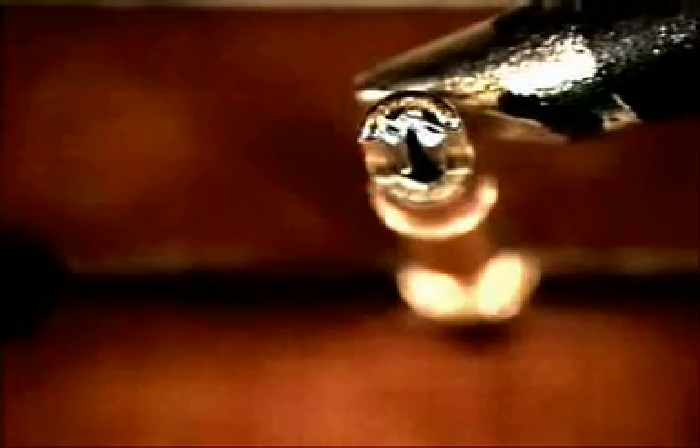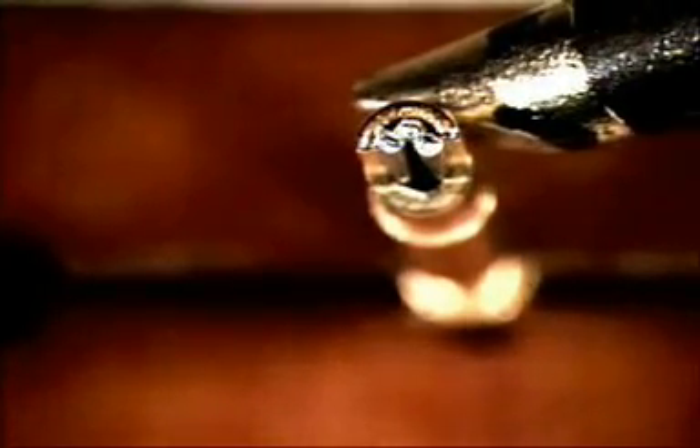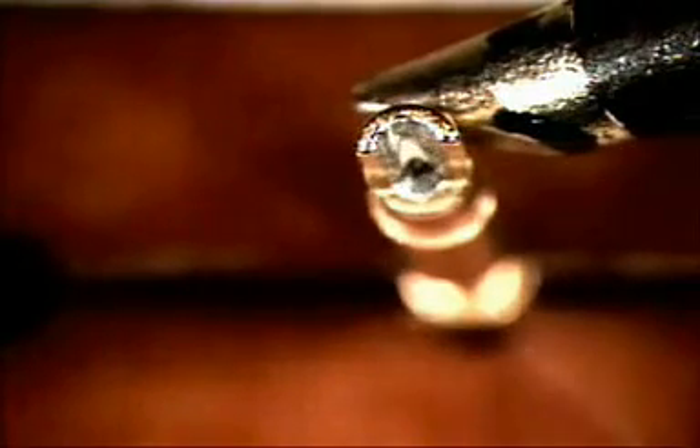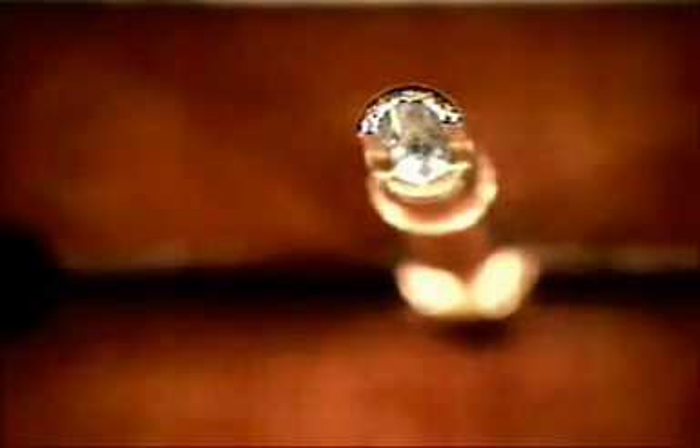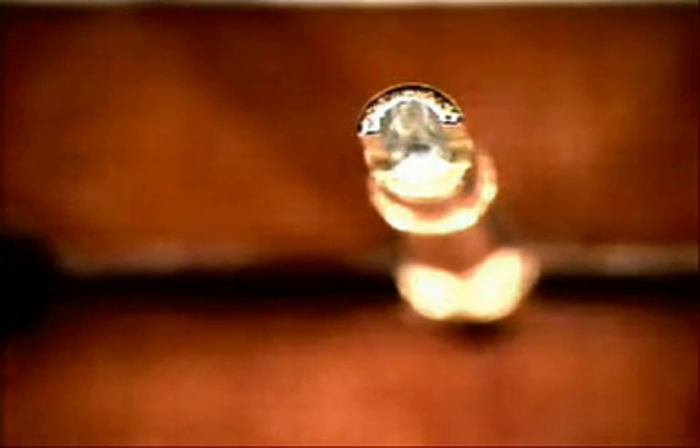Go about center ways, watch the solder melt, then come right off. Next, use your solder wick and remove that solder, because that will help in removal of the gold which can create gold embrittlement — and that's not what we want.